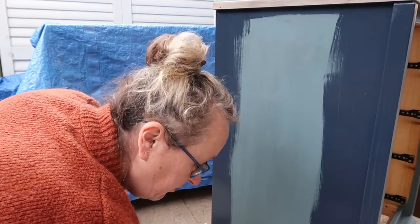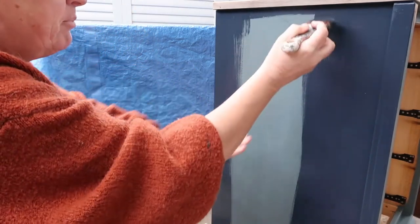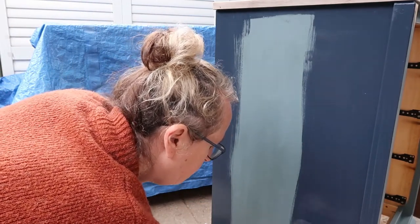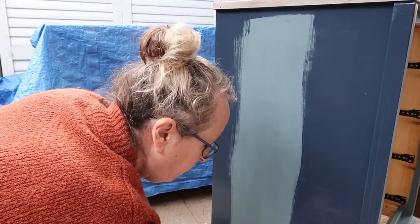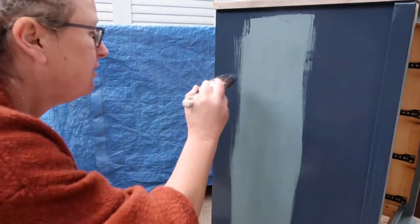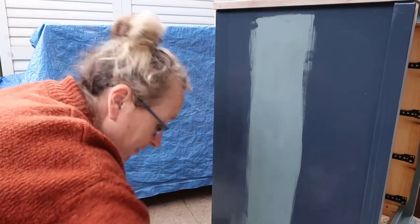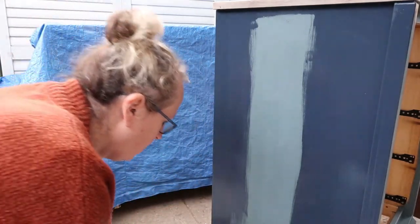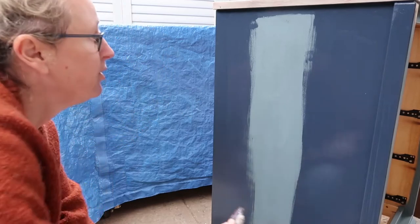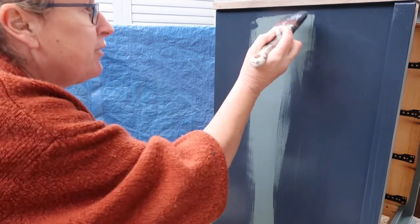So this will be two coats. And like I said, this was sealed with hemp oil underneath, but it was done a couple of months ago so it's fully cured. Painting over it isn't an issue, but just to be sure I scuff sanded it as well, then cleaned with White Lightning which is a de-glosser, and then rinsed off with clean water. Preparation is key, guys. Don't listen to people who say you can paint furniture with no prep — you can, but not if you want it to last. Prep those pieces.